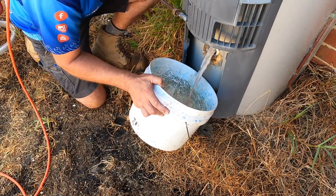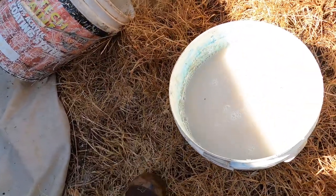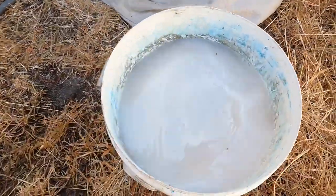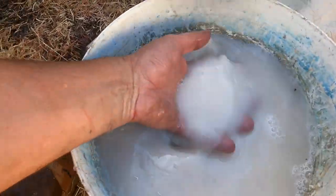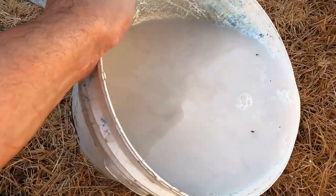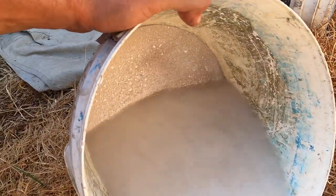Wow. Just doing my final flushes now. This is our bucket — you remember that was clean water when we drained it naturally by itself. Now we've put the high pressure water in there — that's just like milk. That's magnesium, lime, calcium — all the nasty stuff. And look what's in the bottom: a nice thick layer of sand.